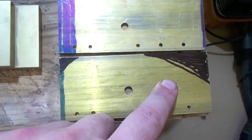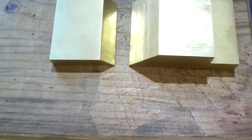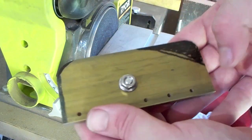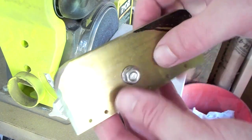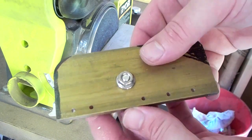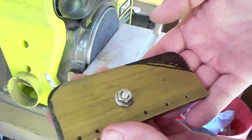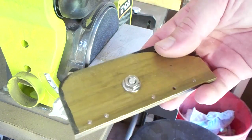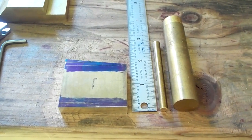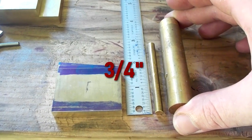Marked out our shape. Next we're going to drill holes in our soles. Starting to shape - the best way to hold them together is to put a quarter-twenty bolt and nut in there and tighten it down real tight. It gets real hot so you've got to do it in shifts. While you're waiting for your sides to cool down, go ahead and cut out a three-inch length of quarter-inch brass - that's going to be for our screw.